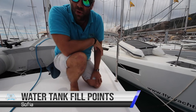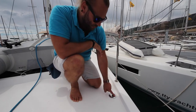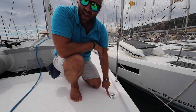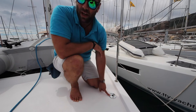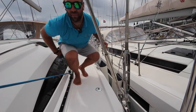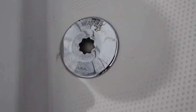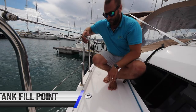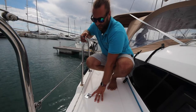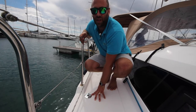Sophia has two water tanks and two water fill points. This one is on the port bow and is labelled water. Make sure you double check anything you are filling is labelled water, as you may be filling a diesel or a waste valve. Fill your forward tank here. The second fill point is midships on the port side — fill your second water tank from here. Your diesel tank is filled from the starboard side at midships. This one says diesel — use a winch handle to open this and fill your diesel here before you return for your charter.